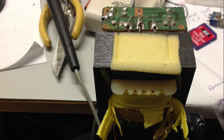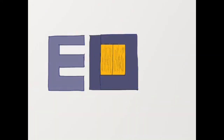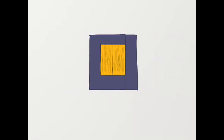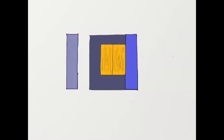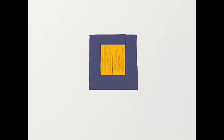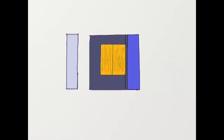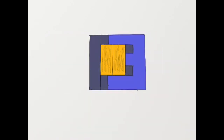The first step after removing the transformer from the power supply was to remove the core laminations. This is a shell-type core with E-laminations and I-laminations. I gently separated the laminations using an X-Acto knife, then tapped out the E-laminations. You can see from this animation why they are called E- and I-laminations. The first one is hardest to remove because the laminations are compacted very tightly into the transformer form. There are 26 E-laminations and 25 I-laminations.